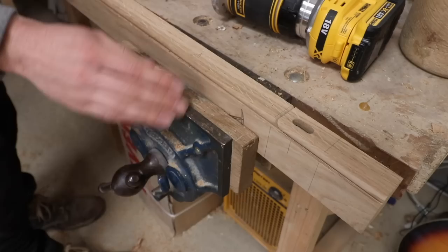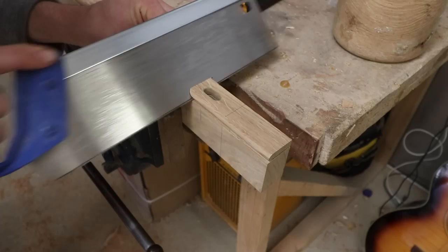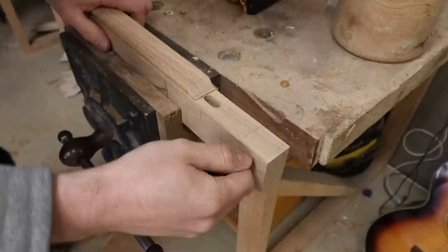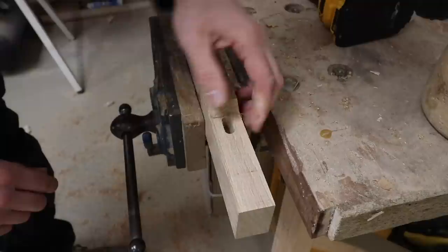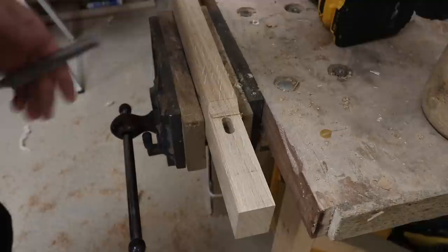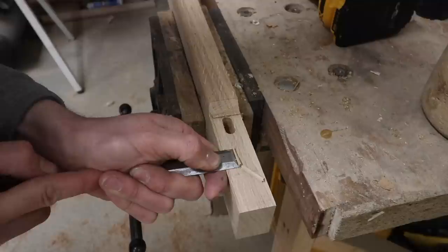Pack the remainder out of that gut. Be dead careful not to go beyond them extremes of that joint. You want every cut to land perfectly in the corner of that mitre. At this stage, I just pare back to this shoulder here, and we've got a very faint groove line in the back edge we put in with that nice gauge. We just want a dead sharp chisel, and it wants to be perfectly flat across that joint to them two shoulder lines. So we just pare across, working across the grain like this, into the centre of the material.